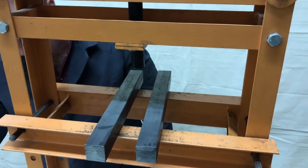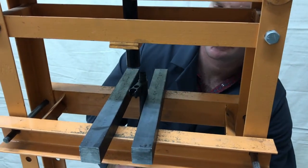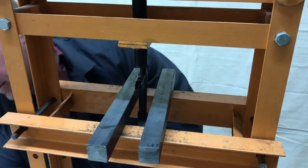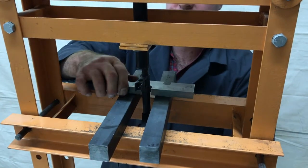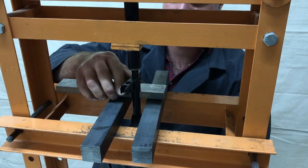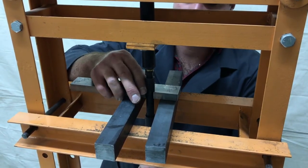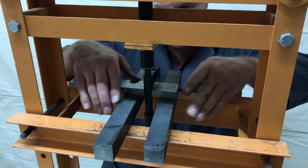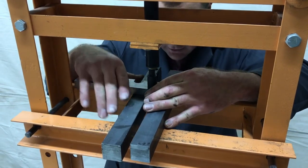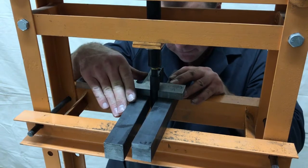Let's go to work. We're gonna set these bars right about like this, and being mindful of the threads on the muzzle, we're going to bring this up. We're going to protect the muzzle, and since this is a Century, I'm using the Century plate. We'll find the smallest yoke that fits — just for grins I'll hang it this way — then narrow this up. I'm not going to have it actually touching because I don't want to scrape up the finish on the barrel any more than I have to. I'm going to roughly center this.